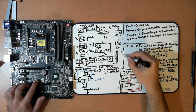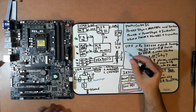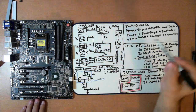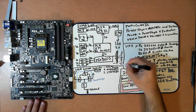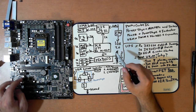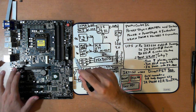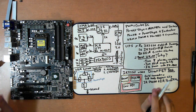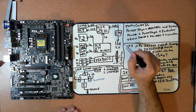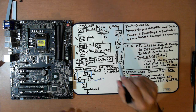1 goes to Marvel for SATA and eSATA, so minus 1 again, and you're left with 2. The Intel NIC always needs its own lane. So that's minus 1 again. You're left with only one more left. So what does Gigabyte do? They need to power some of these 1x slots. Remember, we haven't covered them. Imagine how much of a bitch that is, to have so much connectivity that needs its own lanes, and Intel only providing 8x lanes with their own Thunderbolt controller that eats up 4 lanes. They basically only want you to use Thunderbolt on a motherboard, which is just BS in my opinion.